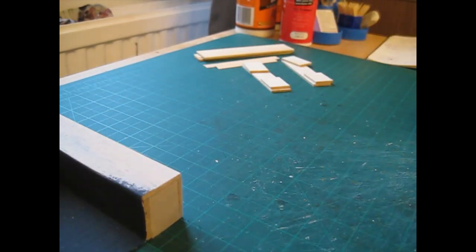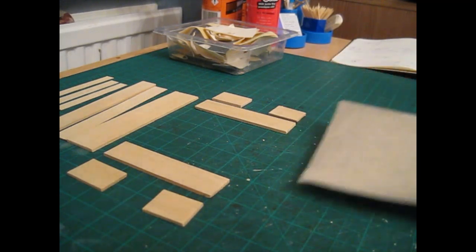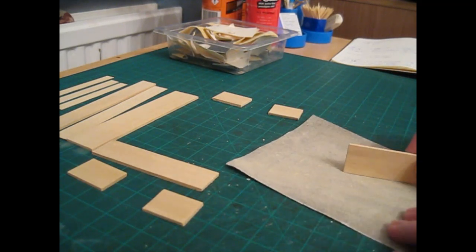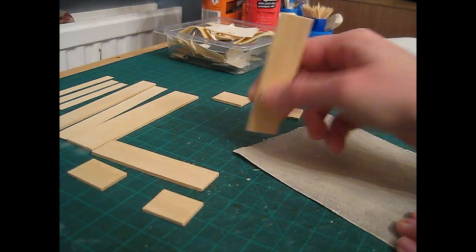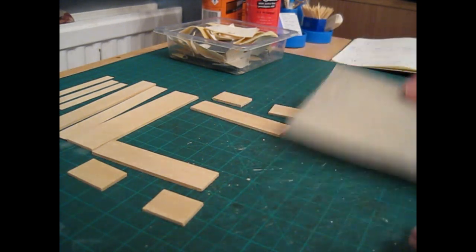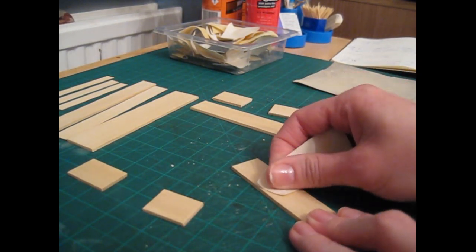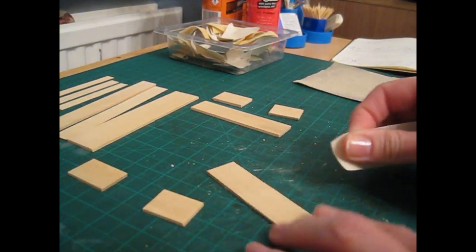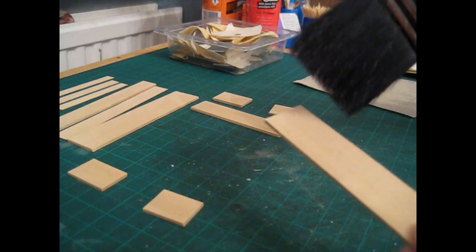Let's start fitting it all together. Once you've cut all the required pieces, begin by sanding along each edge of each piece — with your sandpaper flat on your work surface, just sweep the piece along it in one direction, and do that on each edge. Then sand the surface of each piece using a medium grade sandpaper and small circular motions. That will prepare the piece nicely for paint or varnish. Once you've sanded them all, use a soft brush to remove the sanding dust.